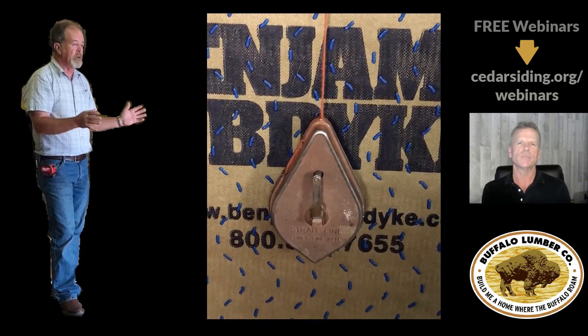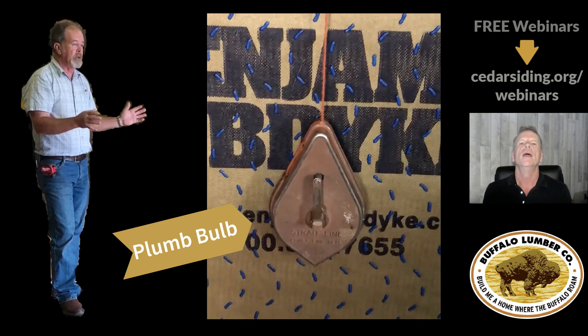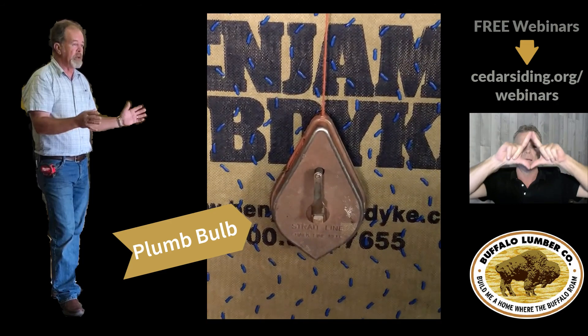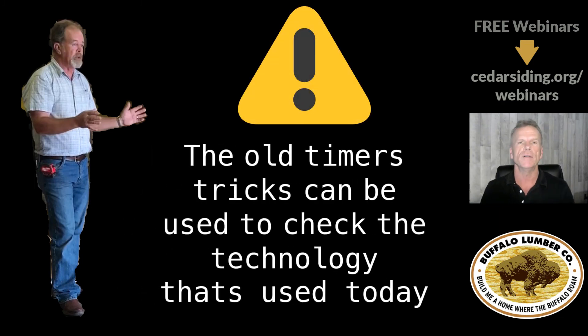For plumb, Dennis has what he calls a plumb bob — a long string with a big heavy piece of metal and a point on the end. When it stops swinging, gravity causes it to stop at dead plumb every time. Unless you were born in the 20s like Dennis, you probably don't have a plumb bob — but every chalk line ever invented is shaped so that it can function as a plumb bob when it settles, and you can snap that chalk line at dead plumb. So along with knowing to set dead plumb and dead level, the old timers also know how to check lasers and technology with the world's oldest technology: water and gravity. Dead level, dead plumb — Chris Buffalo signing out.